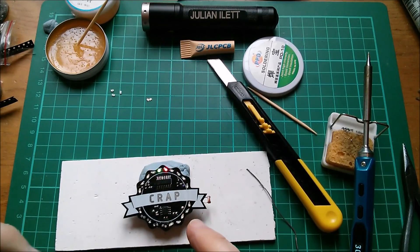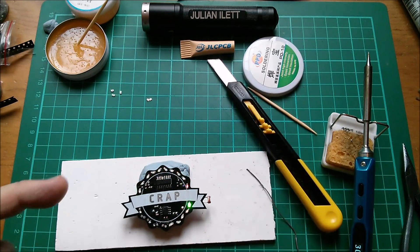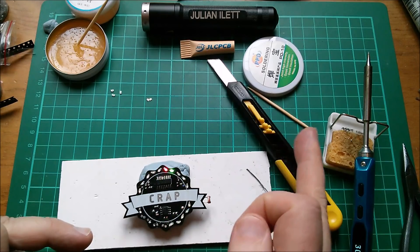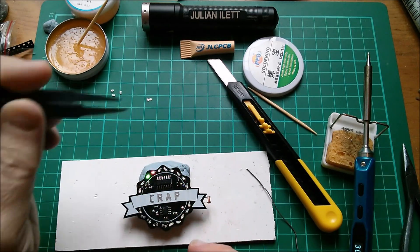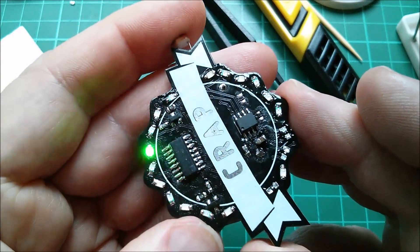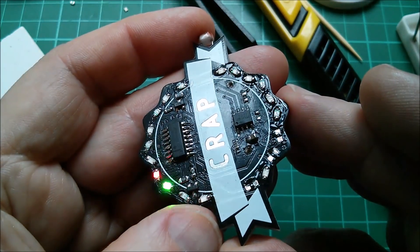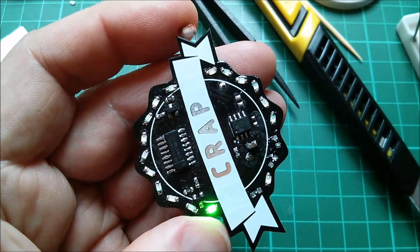The biggest problem with the green LEDs is the lack of any topside marking for anode and cathode. The only way to tell is to repeatedly flip them over - which is a pain in the neck for surface mount. With the power on I'm pressing the LED down with a cocktail stick - if it doesn't light up I'll flip it around and check the polarity. If you're young and find surface mount easy, spare a thought for us oldies for whom vision is failing. I'm using 3.5x reading glasses just to see what I'm doing. Three more LEDs to go.